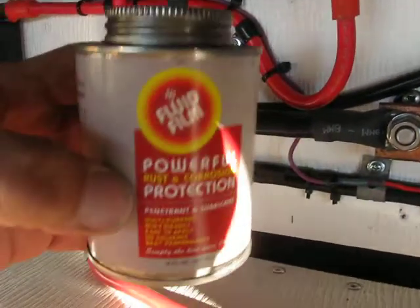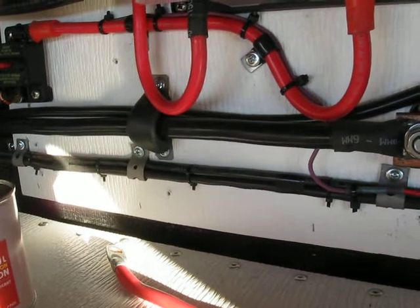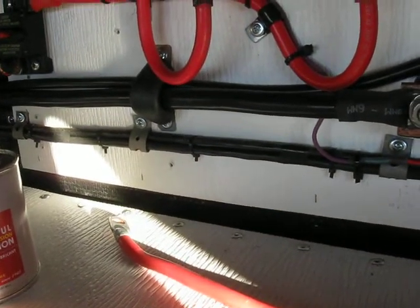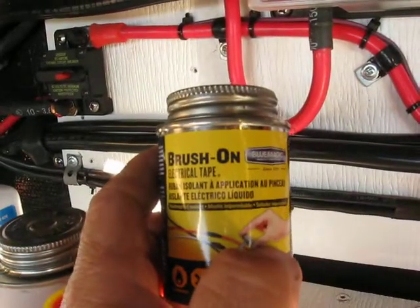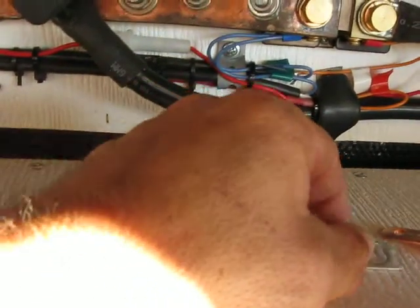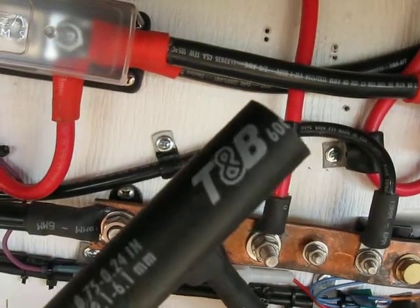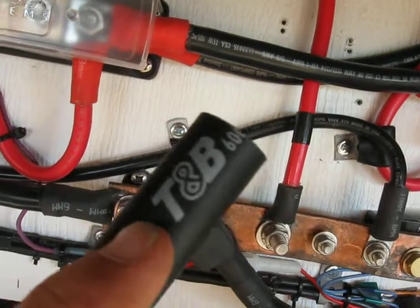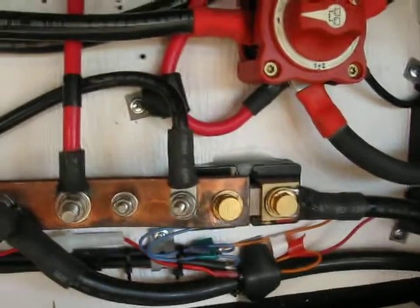When I'm done with that joint, I like to use fluid film — you put it on the outside of it. It's good for battery connections too. You can also use the red battery spray or coating, but I'm not too wild on it because it dries out. If you've got a nick in your wire, you can use this brush-on liquid electric tape — it seals up that joint so it won't get any corrosion in it. I put a little bit of the Ideal Antioxidant on the joint before I hammer it, and then I'll use a piece of shrink tube. A lot of people use electric tape, which is fine, but shrink tube will seal it completely — no air in there means it won't corrode. Corrosion causes resistance, and resistance is going to make it so your solar doesn't work right.